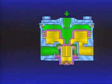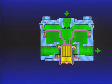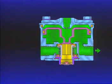This allows the supply air to flow from the reservoir past the open inlet valve and into the service portion of the spring brake actuator. When air pressure beneath the piston equals the service air pressure above, the piston lifts slightly and the inlet valve spring returns the inlet valve to its seat. The exhaust remains closed. The relay valve is now in the holding or balanced position, and service line pressure is equal to the delivery pressure. The brake valve is also in the holding or balanced position.